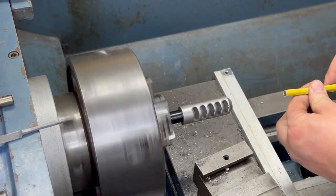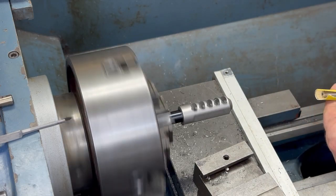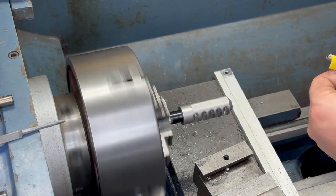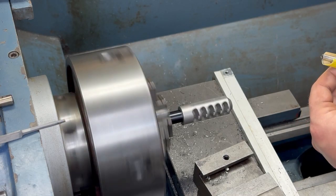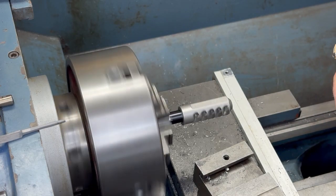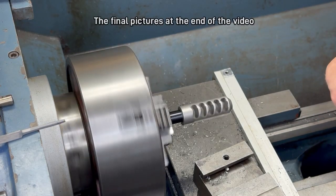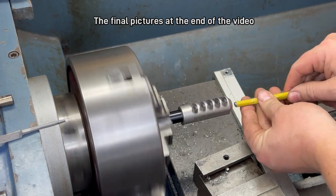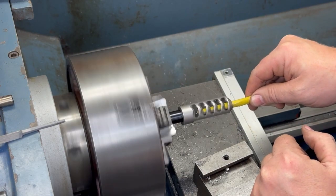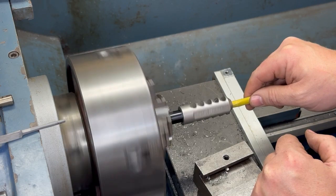The final step is to polish the bore. You can do it a little safer than shown here, either using sandpaper or a chucking reamer of the proper dimension to finish it off. You'll also notice in the final pictures that the back of the muzzle brake has a taper on it as it goes down onto the barrel, which gives a more finished and professional look to the project.